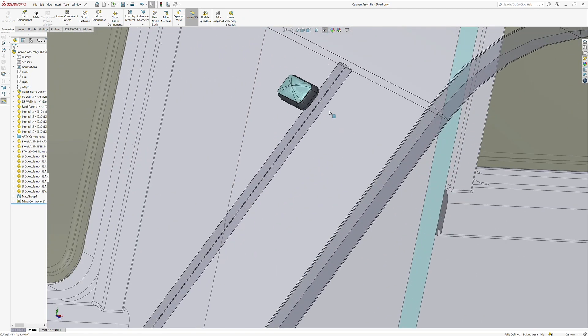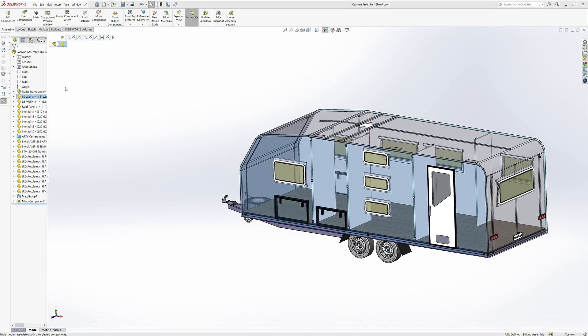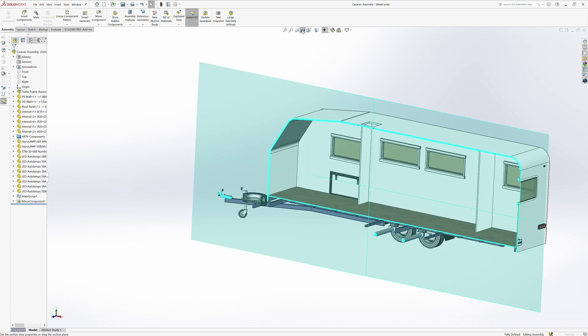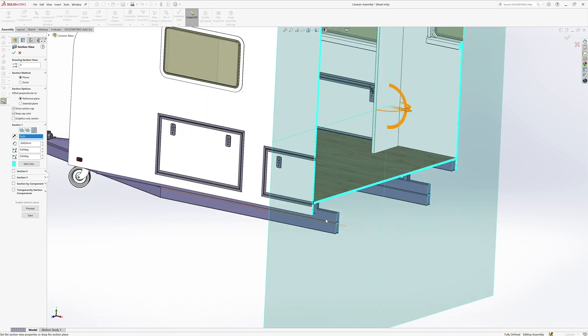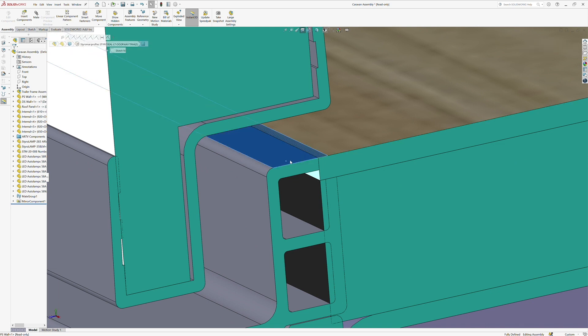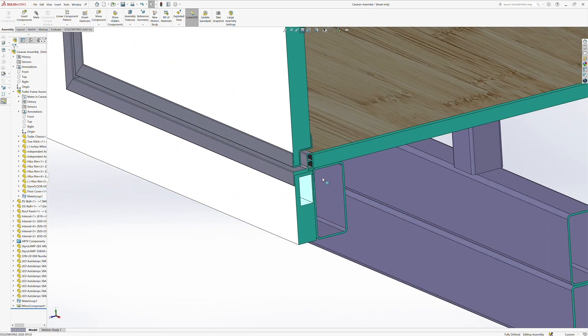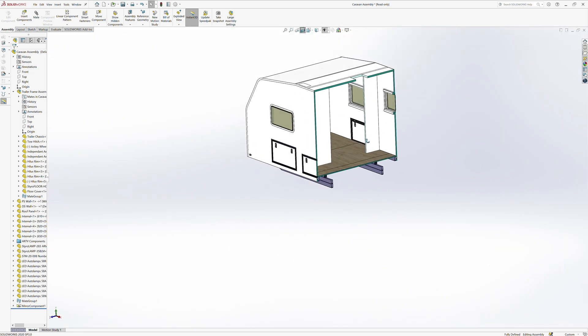You can see the conduits running through the build — we've got styro conduit single up the front, which you can actually bend as we relief-cut, so it'll make its own cavity once bent. Let's do a quick sectional view and look at the detail for the styro seal LT for the hatch doors. The request was for those to be flush with the floor to make it easy to sweep out if you have a tunnel boot. There's a little bit of interference happening with the floor panel and the styro seal LT doorway, so we'll rebate that floor sheet about 1.6mm to allow clearance.